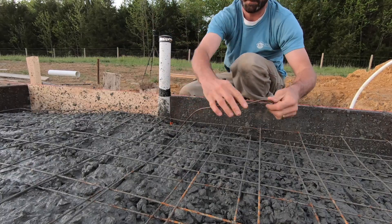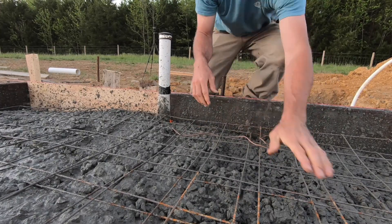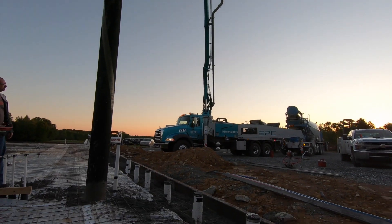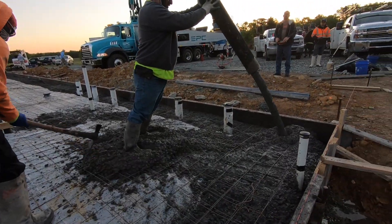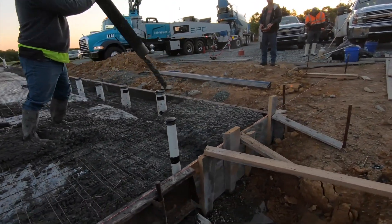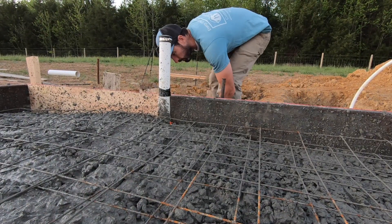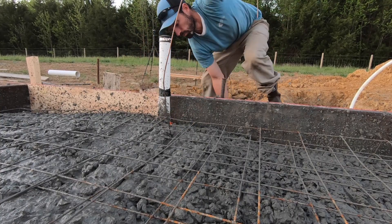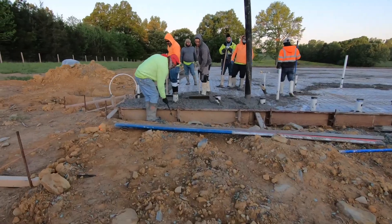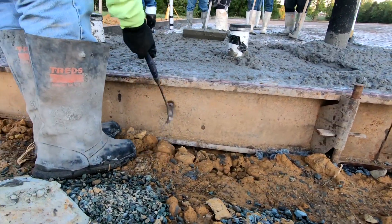For instance, I'm adding a copper ground wire that ties into all the steel reinforcement embedded in the concrete. We've got a lot of bedrock around this site and probably won't be able to drive ground rods a full 8 feet deep, so having that extra grounding force will help big time. The crew started about 30 minutes ahead of schedule, so I was scrambling to get my ground wire in. Fortunately, we poured the concrete footings first with a stiffer mix so it would support its own weight and not put so much force on the steel formwork. I was able to feed the number eight ground wire down through the concrete footing mix and out underneath the form to connect to the future electrical panel and ground rods. The next load is a wetter four-and-a-half-inch slump that's going to be much easier to spread and trowel finish. If I'd been 30 minutes later, I wouldn't have been able to get that ground wire in — so get there early.